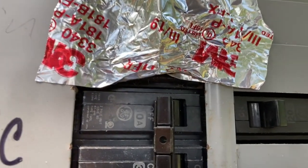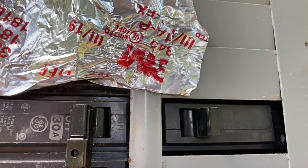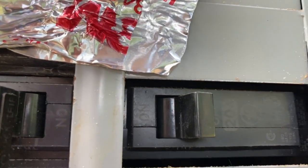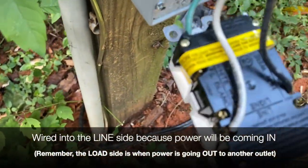I'm going to show you how I wired an outdoor outlet and show you the indicator light, which is very important on the new receptacles. I have the power turned off because you have to be very careful — this circuit is the outside circuit, so it's on a 20-amp single pole breaker. In this case it's a General Electric. I just want to show you how we've got it wired to the line side.